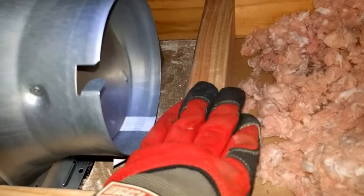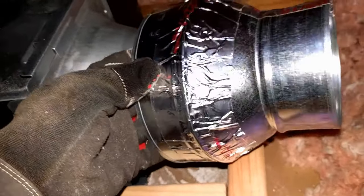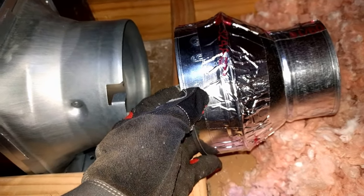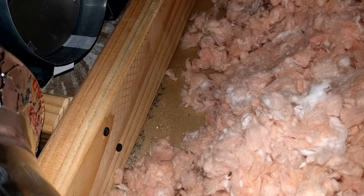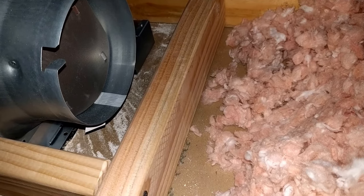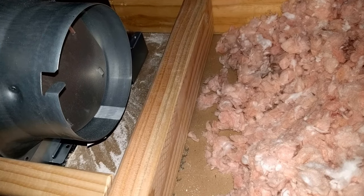Back in my second home — the attic. After cutting away the drywall and mounting the fan from the interior side directly to the header and ceiling joist, that made a world of difference. However, another problem: I used a 2x4 for the header, and it's in the way of the duct adapter piece. I've got a 6-to-4 adapter because I have 4-inch ductwork. I know I'm losing some of the fan's performance by doing that, but right now I just can't go through the hassle of replacing the 4-inch ductwork with 6-inch. The 2x4 sticks out too far — in hindsight I should have used a 2x2. This would have been a great thing to put in the directions, Panasonic. So I'm going to have to cut away part of this 2x4 to make room.